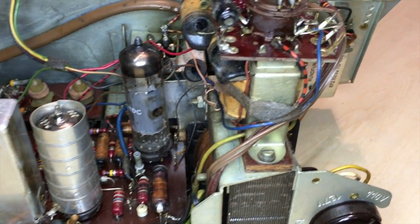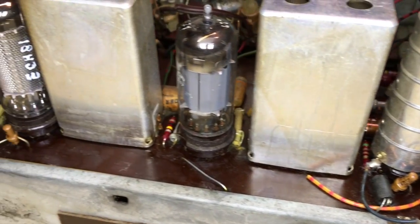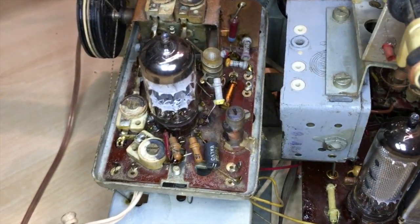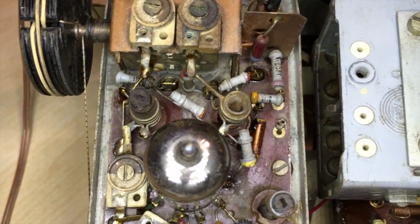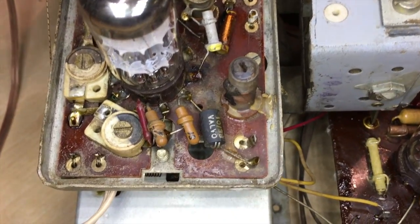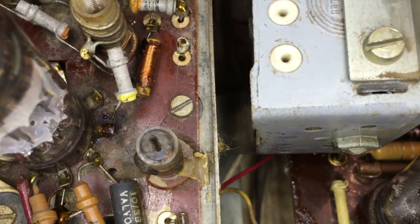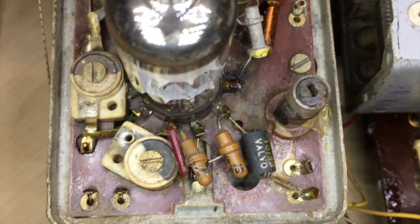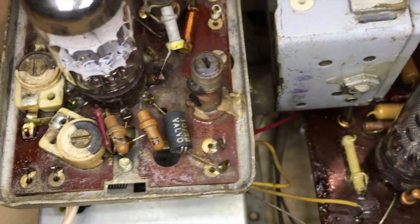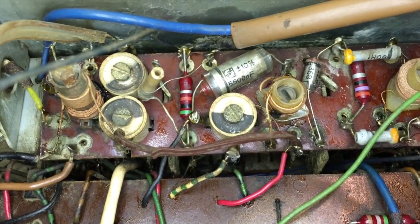Here's the back of the radio. You can see the effects of the cleanup — that old-style PC board is now visible. This is the FM section, which still has quite a bit of dirt in there, but I'm very afraid of getting too rough on it, because some of these coils have minute little wires on them. If I brush them with any kind of force, I'm going to break them, and there's nothing worse than trying to repair that. You see that little wire there? I do not want to get that mixed up and torn apart. Same applies to that section of the board — little coil filament wires everywhere. I had to be very, very careful with that.